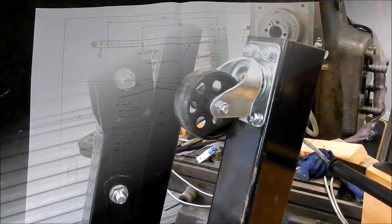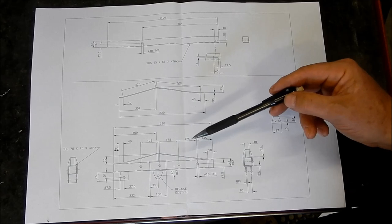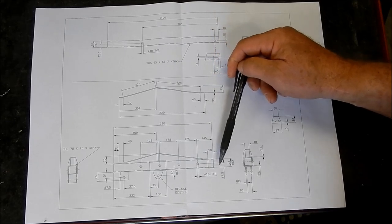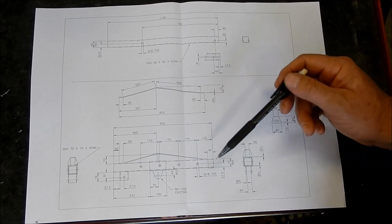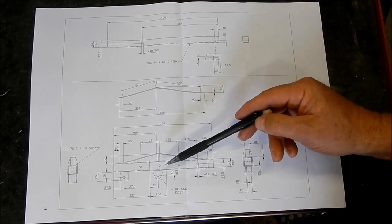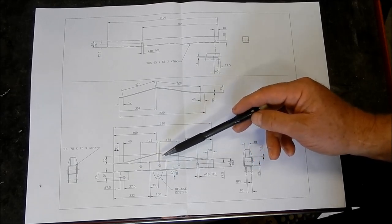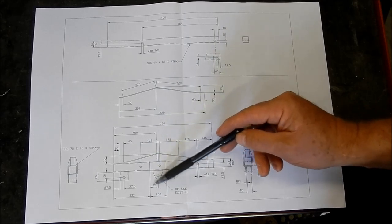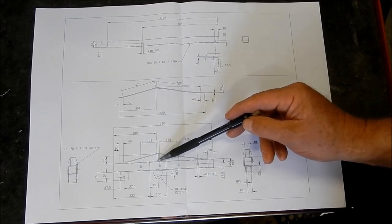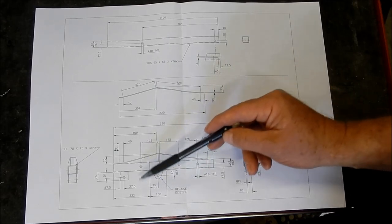Let's get on to it. I'll start with the design - I'm going to keep the basic concept of the tube crane but beef it up considerably. I've increased the arm length by 50 millimeters, which increases the moments slightly but not significantly. To give it better support and stop that deformation occurring at the load point where we're applying the force, I've got 75 by 75 by 6mm flat that we're going to be welding all the way around to give a bearing point. The top post member of the truss is also going to be plated out.